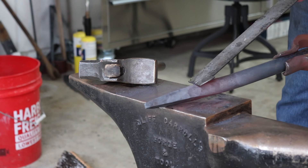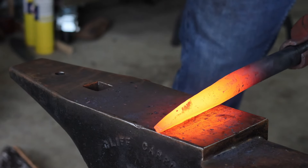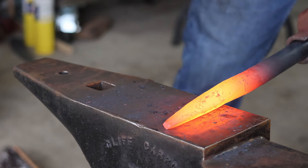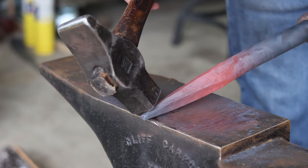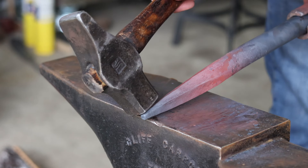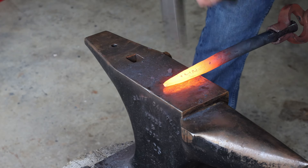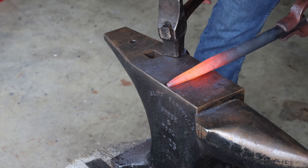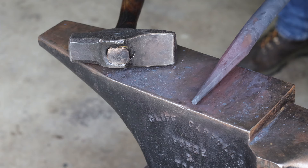The next step is to come in and forge down on one pair of diagonals diametrically opposed to each other. We'll be spreading on the diagonal and flattening this down to eventually get the classic teardrop shape in the cross section. After one heat, this is the progress made on the teardrop shape. The plan is to make this pretty slim and make sure it skinnies down pretty skinny at the tip — obviously tapering in every direction on the way up toward the handle. It's a bit of a challenge forging accurately on that diagonal until you have a flat pretty well established, and this is going to get a decent amount of refinement on the grinder. But the closer you can get to the final shape, the less you have to do on the grinder.